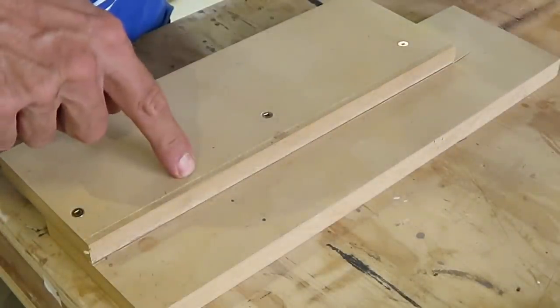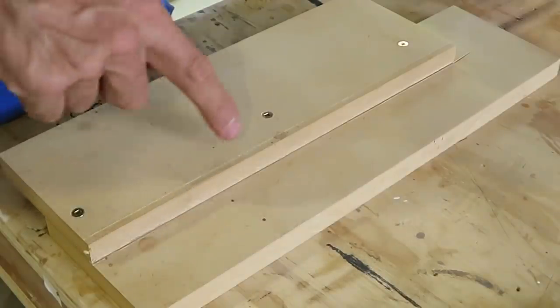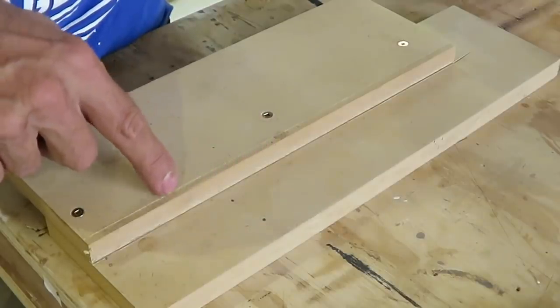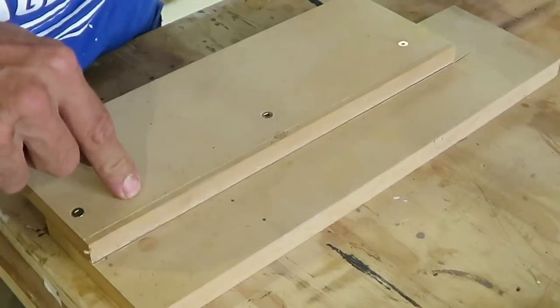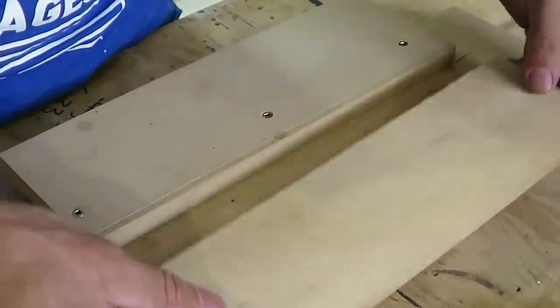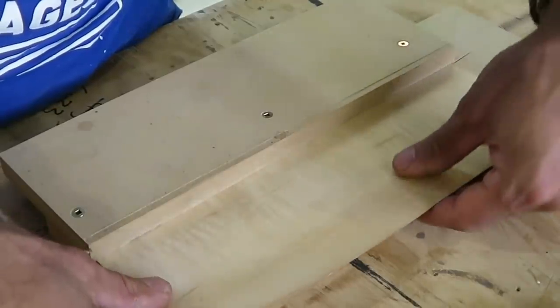So this is just a piece of MDF on top of another piece, and I'm not sure if you can see, but there's a very small rebate on here, which was my practice piece. So there's another rebate like that on the bottom side of there, which is just big enough to fit in the groove we routed in the box lids. So I can slide my piece of veneer into this little groove